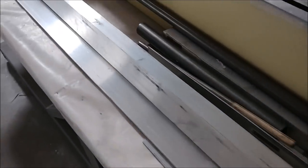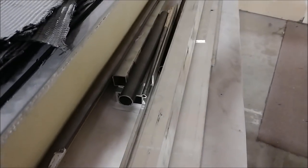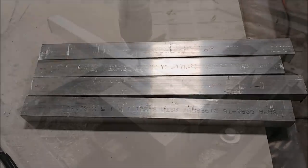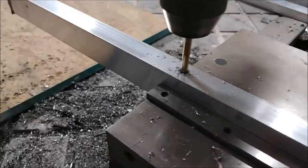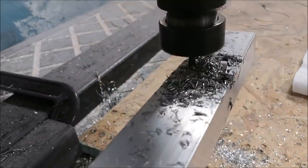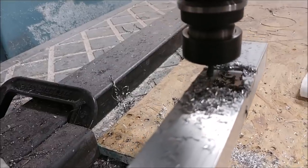Welcome back. Last time I mentioned all the materials had shown up for the rudder pedals, and here's some of it — different bits of aluminum and 4130 chromoly steel. First up is to cut these pieces into the main braces. I've cut those and now I need to drill the different holes and cut the notches so they sit in place. Here's a little bit of the way through cutting the larger holes and openings.